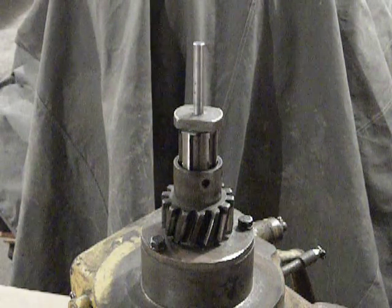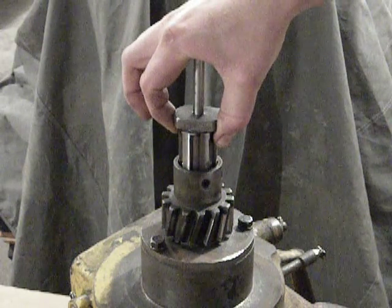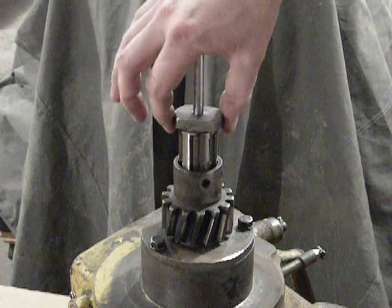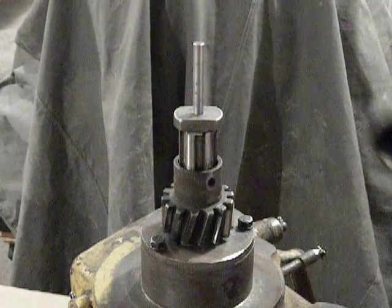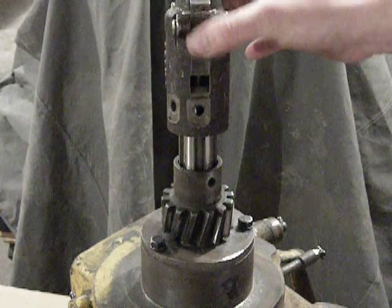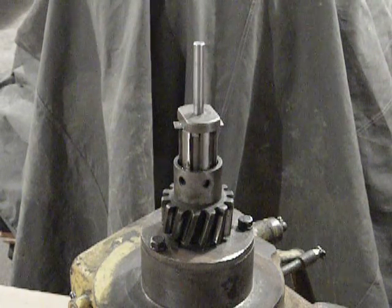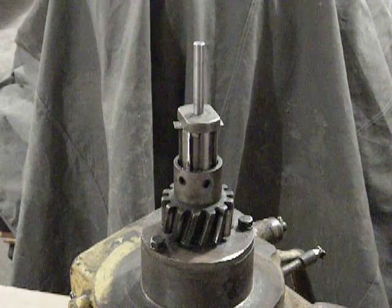The goal of the assembly is to try and ensure that you get your pinion latches as centered on that nut as you possibly can. It is permissible to run them slightly off to one side or the other. You just don't want to assemble the gear to the shaft in a manner that would cause the pinion latches to pass down by the flat areas of the nut — they would have nothing to grab onto there, and the pinion would not stay engaged.